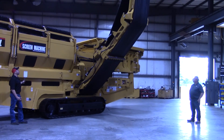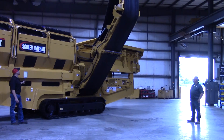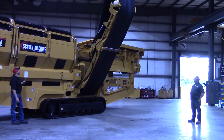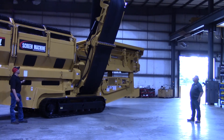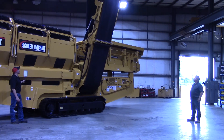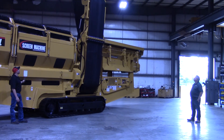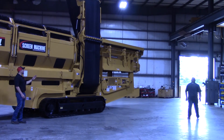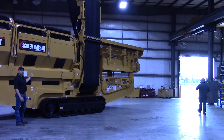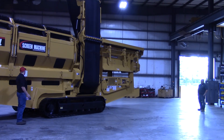Make sure to keep all your equipment, personnel, and all that type of stuff out of the way when you're doing this. Just going to hold on that cylinder until we're all the way up about parallel with the machine. It'll actually kind of fall over towards the machine and rest up against it — that way you know your lower section is all the way up.